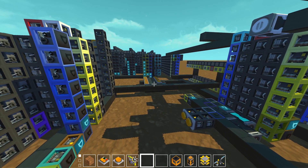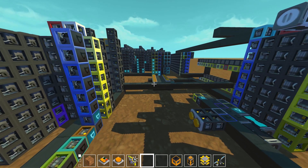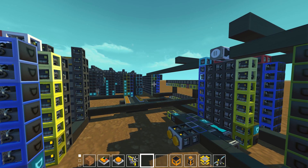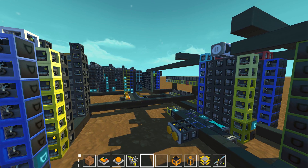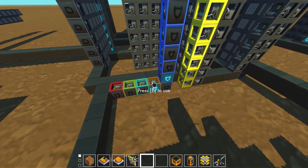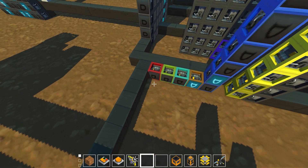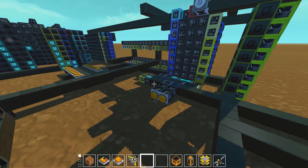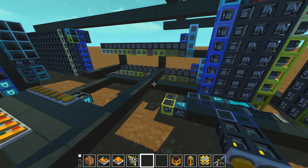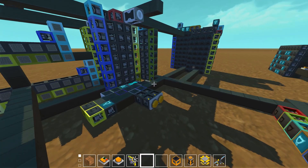I completed — or I'm pretty sure I completed — design of the first official architecture that isn't just a prototype. That stack over there is currently going unused, but that's fine, it's just a separate module that can be optionally plugged in. Besides that, I added a positive flag to complement the zero, carry, and negative flags, so that all of these values are immediately accessible from the control unit.